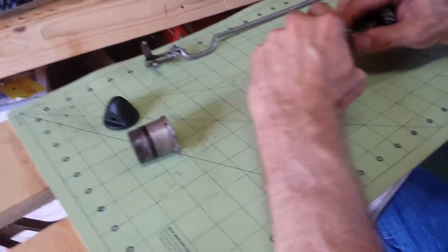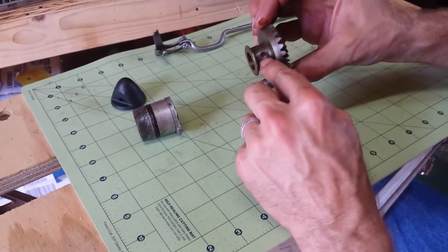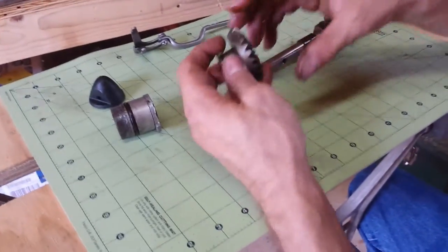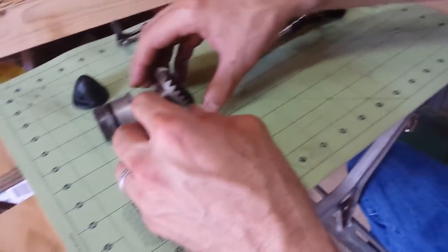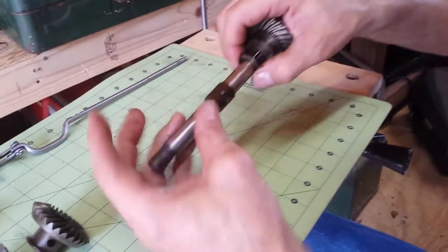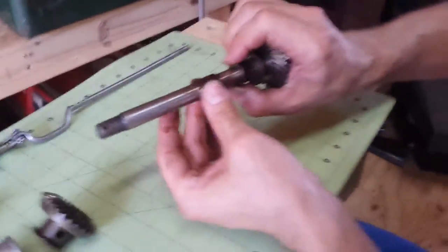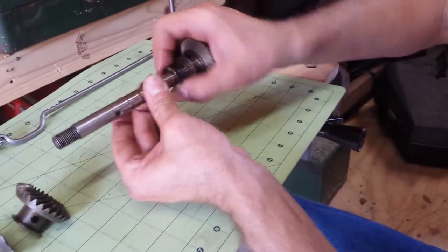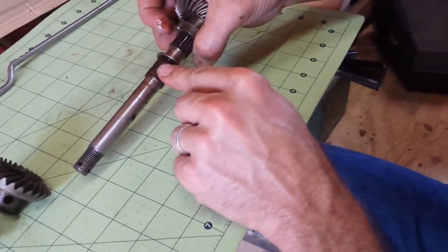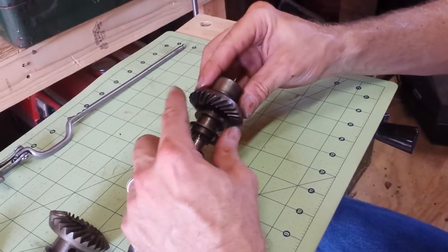Next is the reverse gear — it slides right off of the prop shaft. It has a hole so that oil can be introduced into the bearing and prop shaft from the gear case. This is the reverse gear bearing; it has grooves and slots in a similar way so that oil can lubricate. There's also a washer between the bearing for the reverse gear and the splines for the clutch dog.